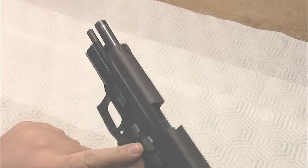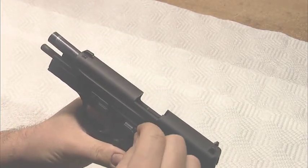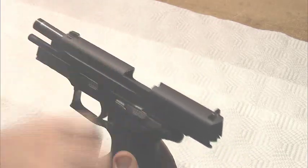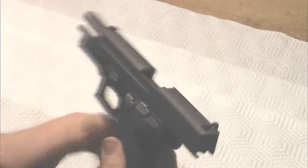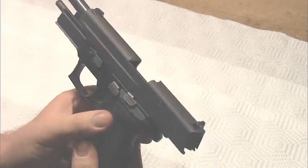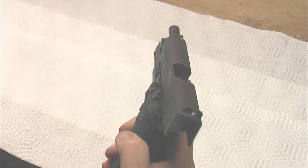When I get this part out, I'll have to cut it down. My plan is to take the part out, heat it up, and bend it so the tab sticks straight out. Then I'll cut off the knob that sticks towards the back of the gun, cut down the width, and leave it sticking straight out a little bit — enough to get under and push it up, and a little to push it down. Then I'll grind down some of the plastic on the grip.